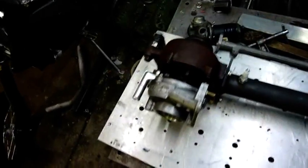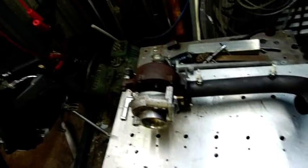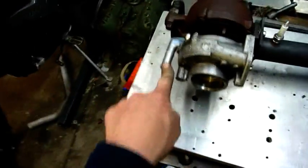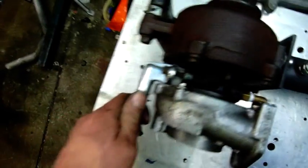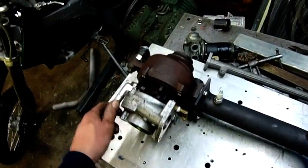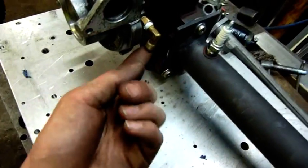Alright, we're almost ready to hook up the compressor to the combustion turbine, and I'm starting to build a fuel pump — I sort of have an SU gasoline pump from a Jaguar but it should work alright with Jet-A. If not, I'll go high pressure and use a moderated or regulated power steering pump on a variable speed motor. The oil return's done — that's the fluid return from a Hyundai power steering pump. I've made a standoff bushing out of Teflon — PTFE should stand up to the temperatures. Acetyl or polypropylene would melt, so PTFE is the best choice. The oil inlet line's ready to go, I just have to hook that up to a pump.